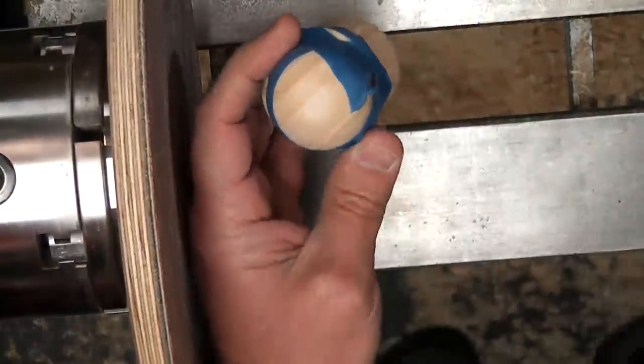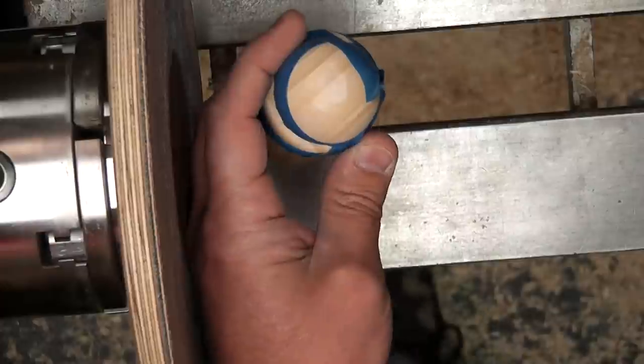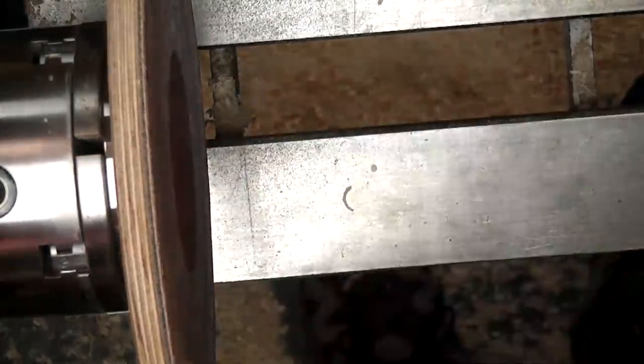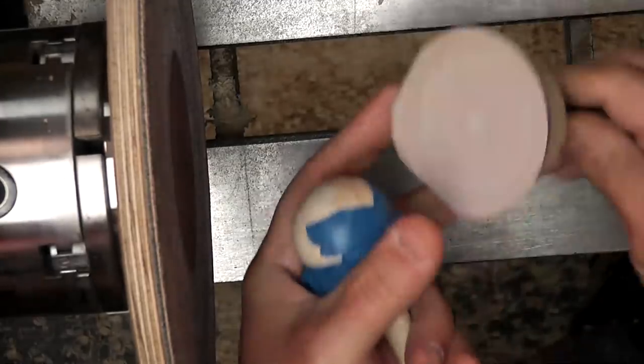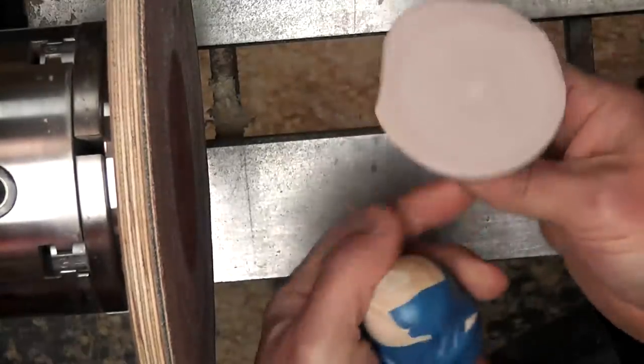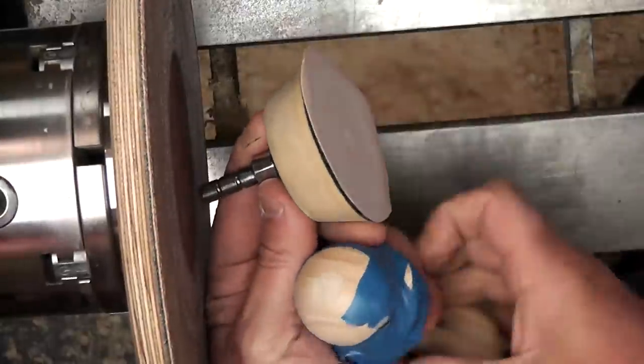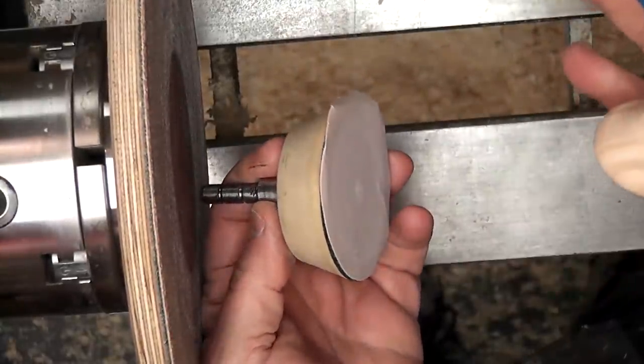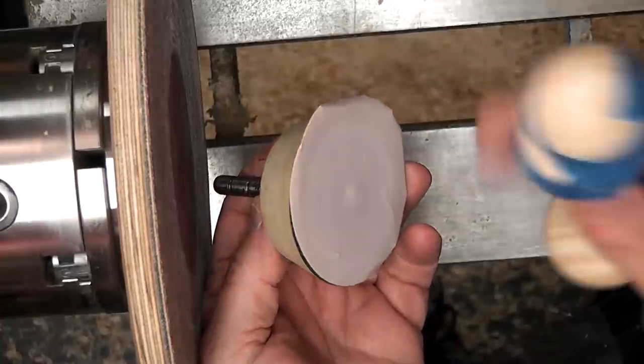What I would normally do now is go to one of the rotary sander heads. So use one of these in my pin jaws, because I can use these down to 400 grit. So if I've got that held in the chuck, then I can use 400 grit and clean those other bits up. We've used that numerous times. You see me do that quite a lot.